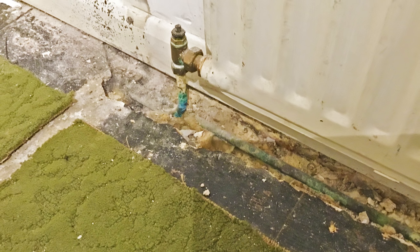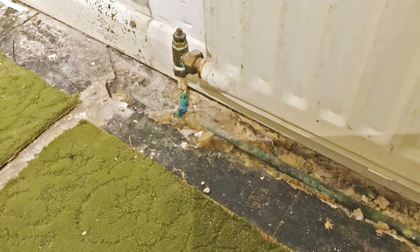Travis is concerned about sucking the water out since there's no drain-off. Get a wet-and-dry vacuum cleaner and suck that pipe completely dry — you can't solder a wet pipe. Any water present will create steam that blows through the solder and the joint will fail. I would use solder rather than a compression or push-fit fitting if you're going to bury it under screed. But ideally, go back to something decent: put a new bit of screed back with self-leveller. If you're doing that much, you might as well do it properly.